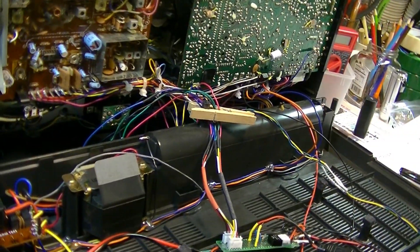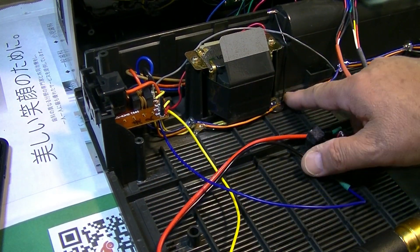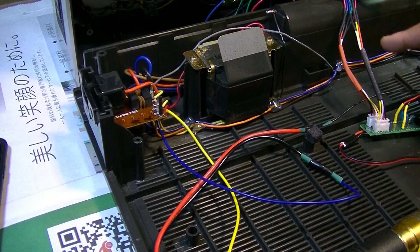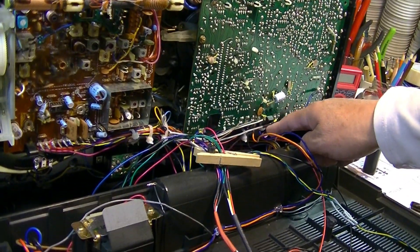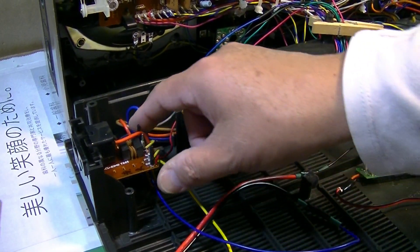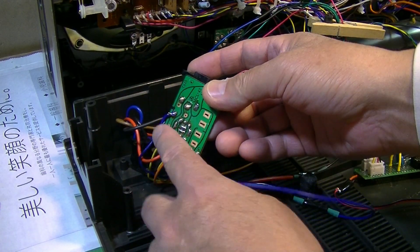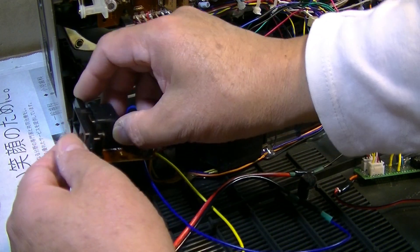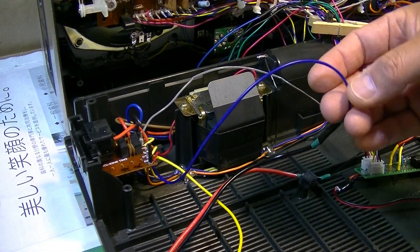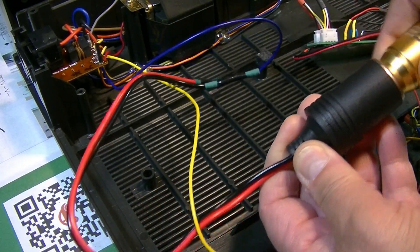Let's start from the power. Here is the orange and here is the blue, coming from this power unit, going into the amp section — negative and positive. I also soldered wire from the other side. So 14 to 15 volts comes in here. This is the negative. Negative one goes into the black wire in this socket.